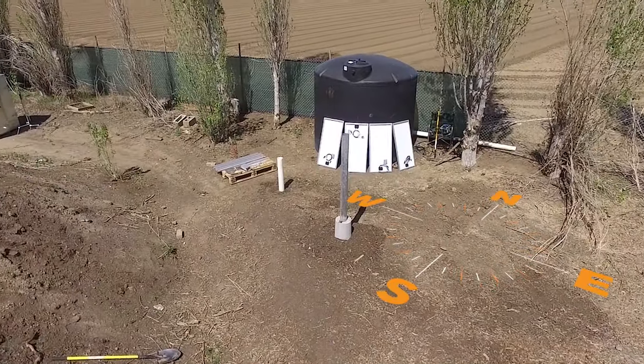Our bucket test was successful. I highly recommend you do the bucket test before you drop the well pump down the well because it's much easier to troubleshoot anything here at the surface where we have access to the pump, the splice, and all of the wire. In order to get ready for dropping our well pump down the well, I'm going to attach our low well sensor — this is very important, it's going to prevent our pump from running dry if we're over-pumping our well and will protect our pump and motor from overheating. We attach it around one foot above our drop pipe using some electrical tape.